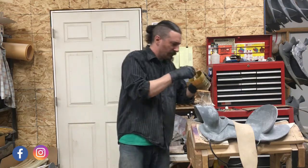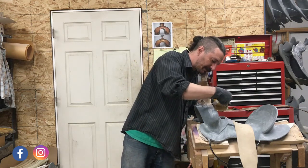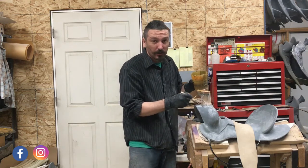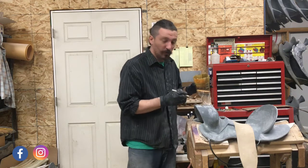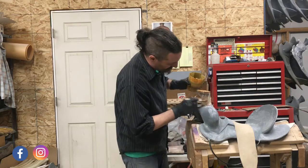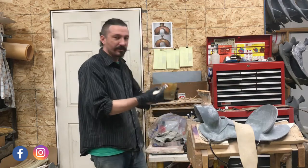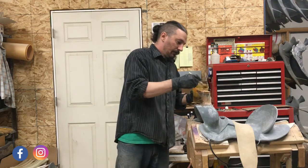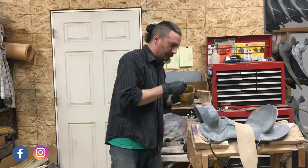all right, anything you've got left, go ahead and pour it on the cap. With fiberglass, it will become transparent. With Kevlar and carbon fiber, you won't know if the resin has penetrated at all. And Kevlar will not sit the way you want it to. It's not going to do it until you get it down and saturated with enough resin, and then you can put your top plastic over it, and then whatever your binder is, either cloth or fabric or your rubber bands or rubber or whatnot.